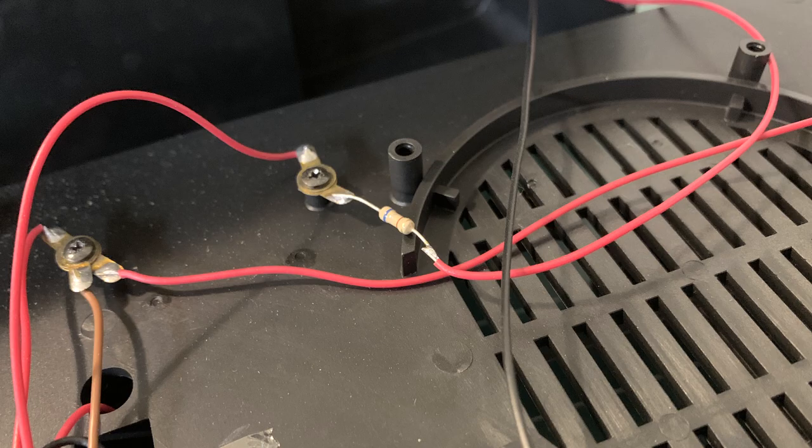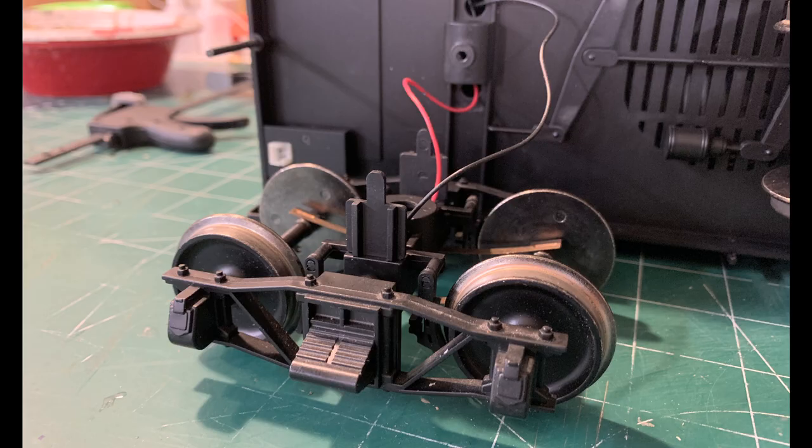With very few exceptions, there are one or two things we are keeping. This simple little resistor is the dropping resistor for the LED tail light — rather than try to rematch it with a different resistor, there's the proper one right there. We're also keeping the red and black wire bus that runs the full length of the locomotive carrying track power from all the driven wheel trucks. No point cutting into any of that.